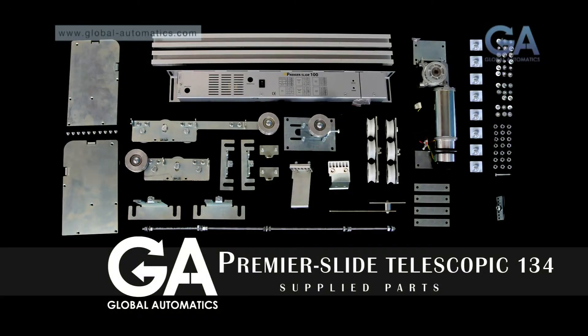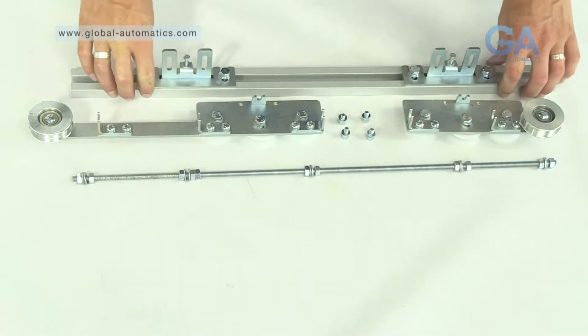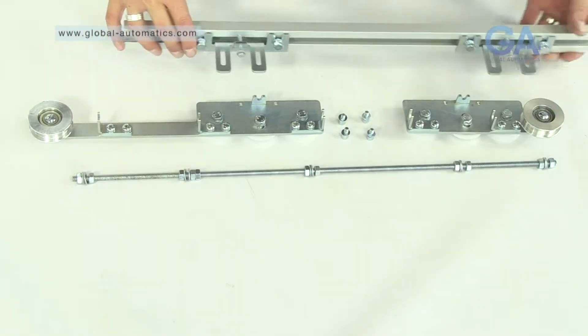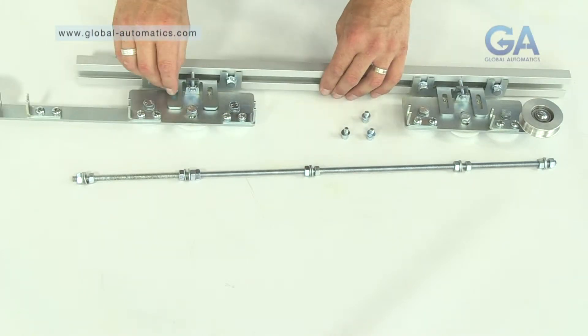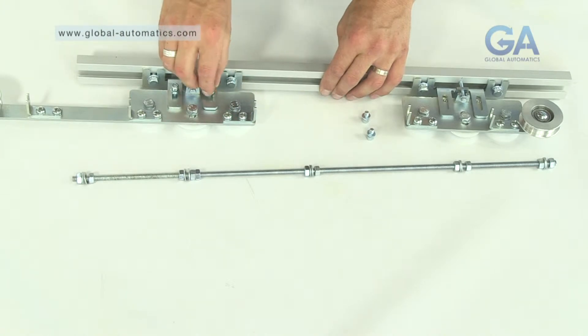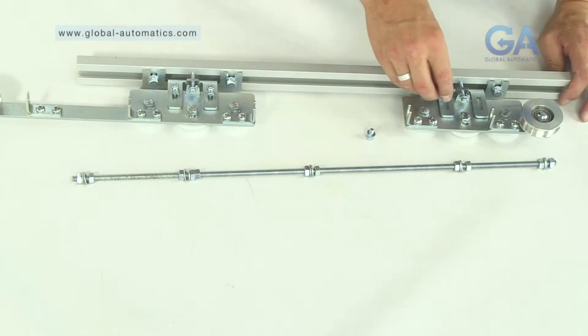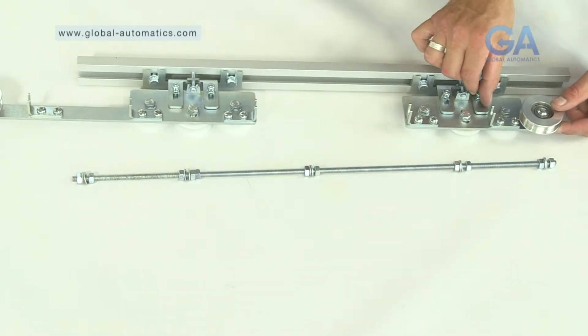Building the slave leaf. Select the long arm and the short arm carriage assembly, the studding and four 12mm Allen bolts. One, line up the back carriage assembly that was just assembled with the long and short arms as shown. Two, fix into position as shown using the Allen bolts and tighten.